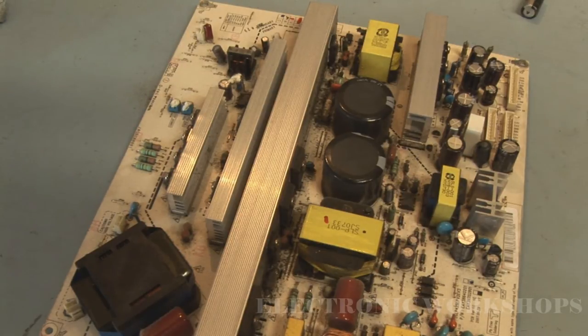C222 is a 470uF rated at 25 volts, 105 degrees. Use only good quality capacitors in these positions — if you use poor quality capacitors, and there are a lot available out there, you're only going to have to keep doing this every three months. These capacitors are available from good suppliers.